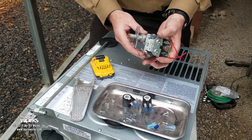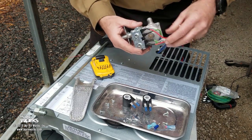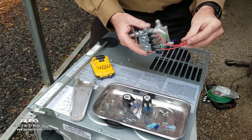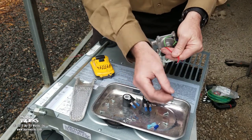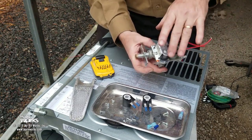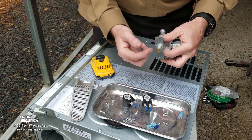Now, this is your gas valve. So gas is introduced here through your LP line. It energizes these. I have a redundant solenoid, okay? And these go on a little connector that unplugs and they're grounded. There's a ground spade right there. 12 volts is energizing it. Gas goes in here, I energize my solenoid, gas flows through, and I squirt through the orifice.